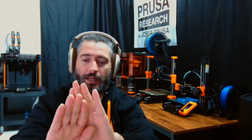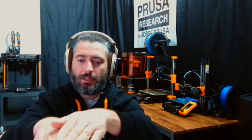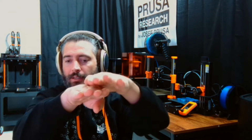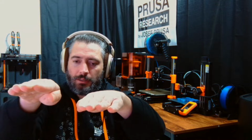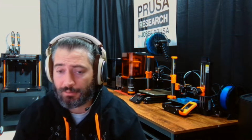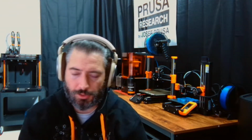They're a little bit separate if it's too high, but then if it's too close to the bed, they overlap too much. And when they overlap too much, it starts to stack plastic on top of itself, and that's not good either. So if you get a perfect first layer, it's side by side wonderfully. And once that's set, there are some of my printers where I haven't touched that setting for a long time, unless I physically do something to the printer or change out my sheet to a different build plate surface, like a smooth plate versus a textured plate.